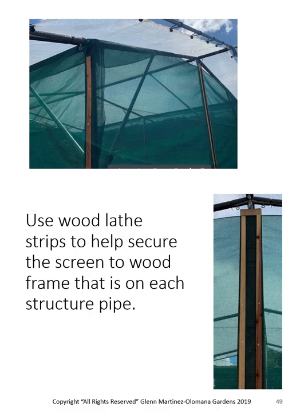The last strip on the inside is one-by-four. Brandon stapled his screen to it, then screwed on the last strip over the top — screwed, not nailed. When he wants to relocate, he unscrews the wood and with one yank pulls those staples off. They're very lightweight staples, only made to hold long enough to get the last strip up — very clean installation. He used redwood, which means he doesn't have to mess with staining because termites and fungus don't like redwood.